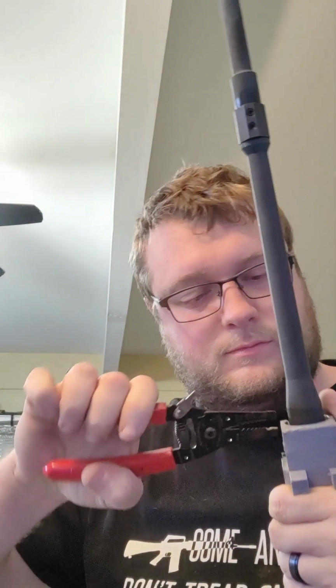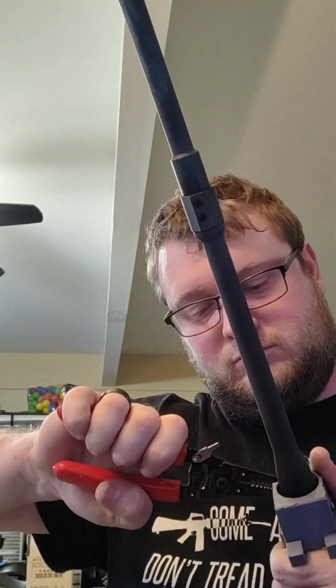Okay, so on the barrel mounting, we had a fracture along the layer lines, as one would expect, of this portion. And so the top barrel cross pin came out. The top barrel cross pin is no longer properly aligned. So we can just unthread that. That's not actually coming out, so let's just pull it. There we go. Cross pin's out. That was barely even being retained.